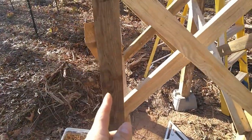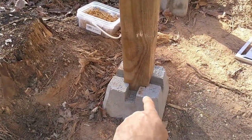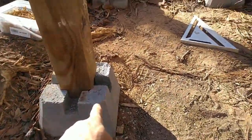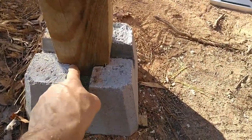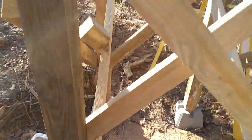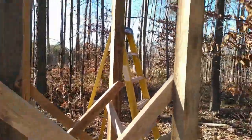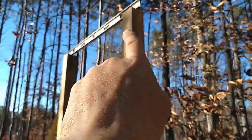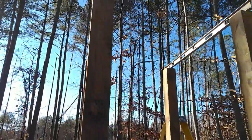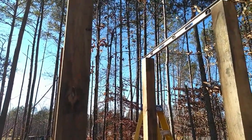The concrete supports are set up for a dimensional 4x4, which is not actually 4x4, so I had to notch them. I notched it down keeping the outside corner — the natural corner — and trimmed them off so I could square things up. Got everything level, put in cross supports, then measured up on one 4x4, cut that one off, and used the level to scribe lines and kept going beam to beam to beam. Now all four beams are running parallel and level.